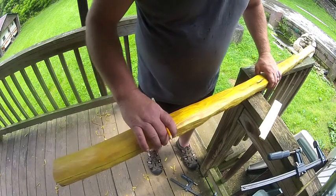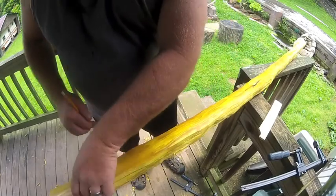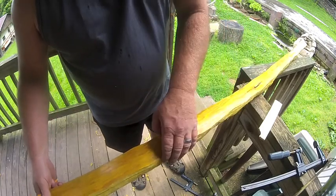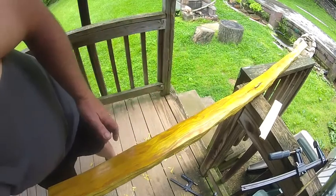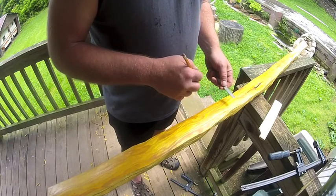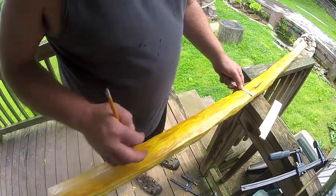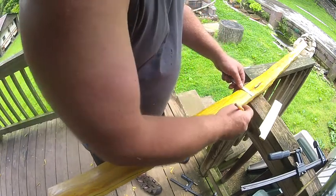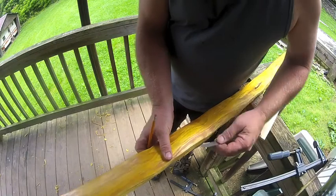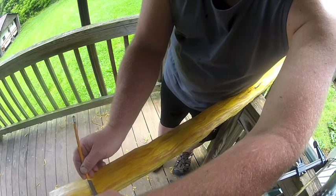Right in here, I'm going to show you real quick — see the way this grain flows. I just kind of let it naturally go where it wanted to go around these knots, all the way down on just this one side that I've marked. I'm going to come back in. This is all just going to be rough. I'm probably going to go with a pretty wide bow and just taper it at the tip from about eight inches back. I'm going to follow this grain here on this side and go about an inch and three-quarter.